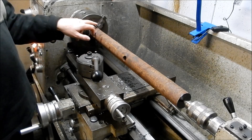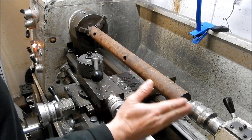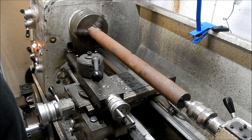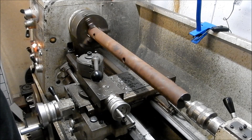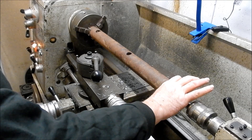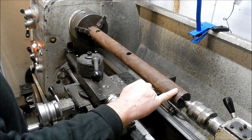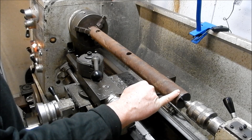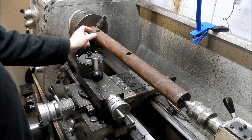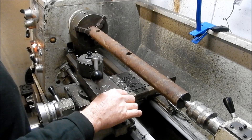We've got our aluminium packing in our jaws and put our center into place. Now this does have a slight wobble in it. As I mentioned, it's good to have the shaft OD oversize to allow for that little inconsistency when you center by hand. But what that allows me to do now is to get a machining band at the tailstock end and a machining band at the headstock end, which allows me to fit up my fixed steady.